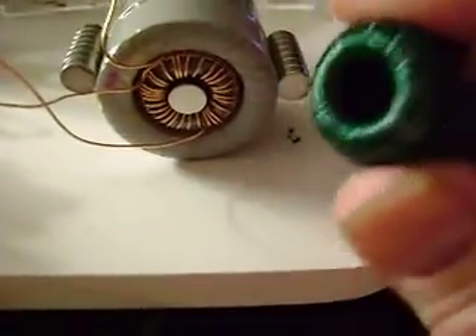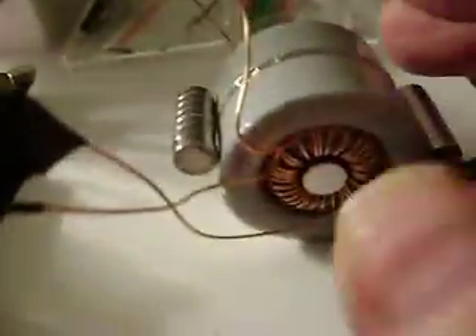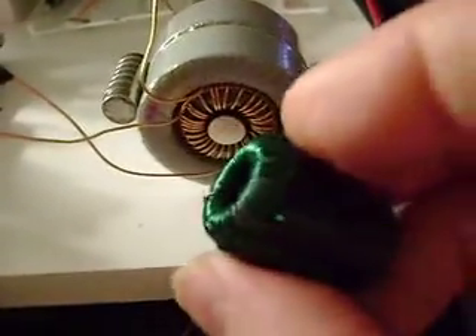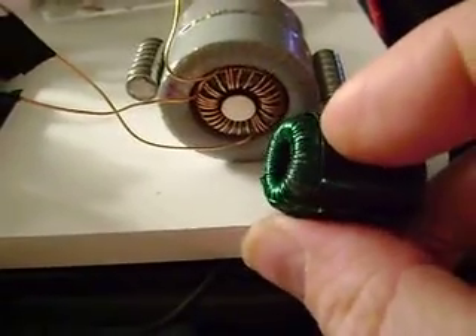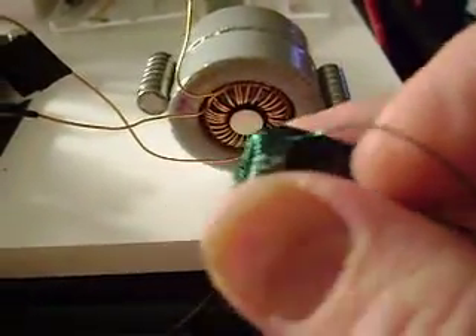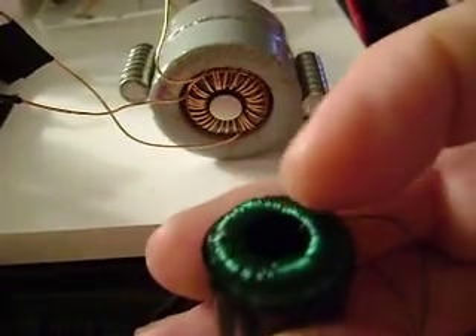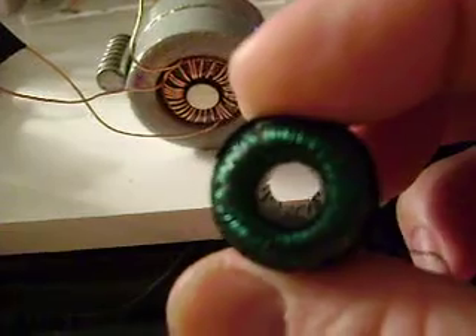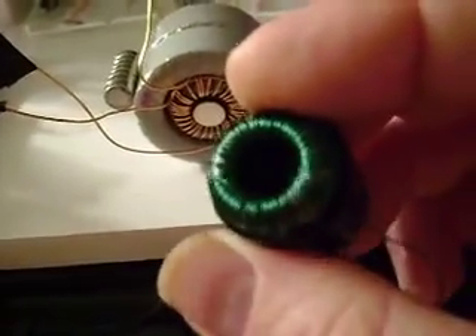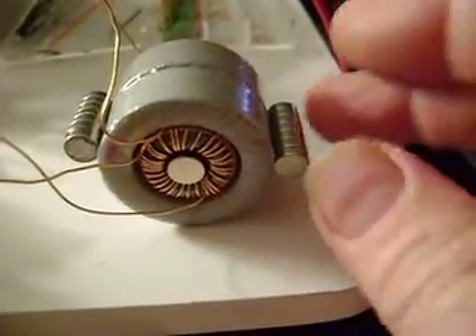Here's my other one - it works good too. This one works at a higher frequency of resonance. When I set up these resonance things, this is giving me higher frequency resonances that I have to find a frequency of pulse that kicks off those resonances, and then we gain on that effect. This one resonates at a little bit lower frequency, but the output is very similar. This one has three layers of 150 turns of the same wire - the 26 gauge that comes from Radio Shack, you get them both in the same package. Then as many wires as it takes to cover the inside fully without overlapping them, so the magnets will slide in nice and tight. You get good effect from both of them. And the biasing magnets make a difference.